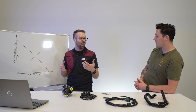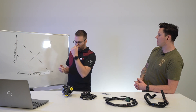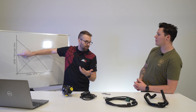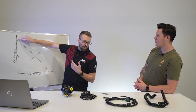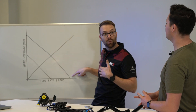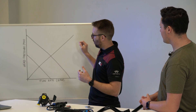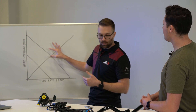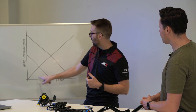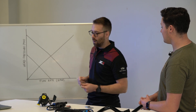Head pressure is the difference between the outlet pressure and the inlet pressure of the pump — a common term used when referring to the capabilities of a pump. Every pump has a maximum head pressure it can produce before it stops flowing. Down here at zero flow rate, you have a single pump that can create X amount of pressure. If you double the pump, you get a higher number up here. That value drops off — the pressure drops off as your flow rate increases, as you reduce the restriction in the system. If these values were linear, a single pump and a double pump system would produce about twice the flow rate.